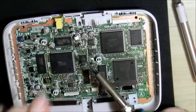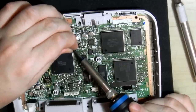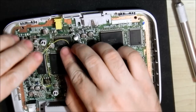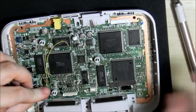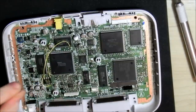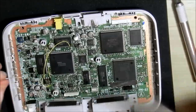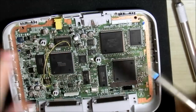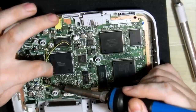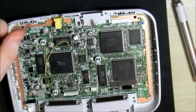What I'm going to do with these points, instead of having it flat, I'll take it straight up. That's wire number three. I want the chip to support itself a little bit instead of having it straight and taut — when it gets a bit hot in summer or cool in winter, wires actually expand and contract, and they can lose contact if not soldered properly, like in the case of the chip we originally had.